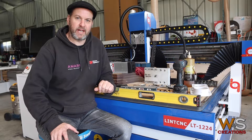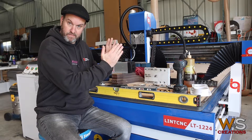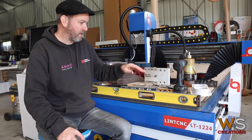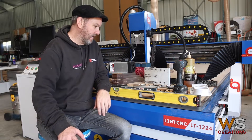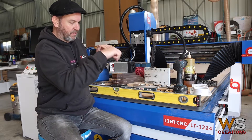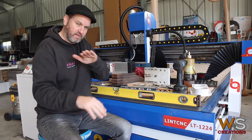What we learned yesterday is that this machine's spindle was out of whack by about five degrees. When I was doing a level of my wasteboard, it was throwing a lot of grooves up the length of the board, which told me straight away that the spindle's out — it's leaning, so this side of the wide cutter bit was grooving instead of just flattening.